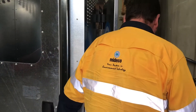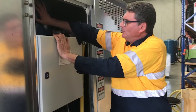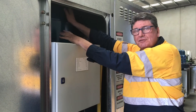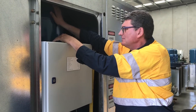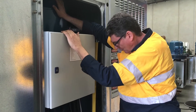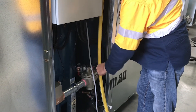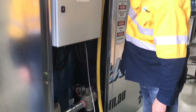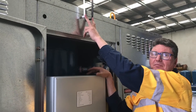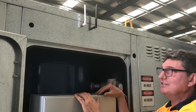This is where the power of the unit comes from. Basically we have an air receiver which we just keep topped up, but the driving force for that blast was actually the air receiver, not the compressed air line. We use a PLC to operate all the valves. There's also pressure regulation and flow regulation. Also in here is the router, which gets the information back to whoever needs it as and when required.